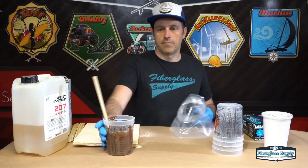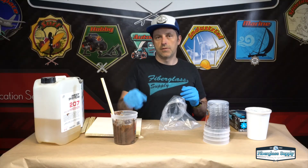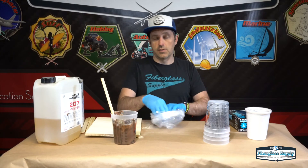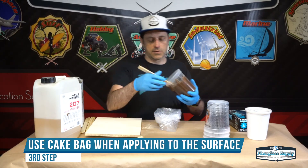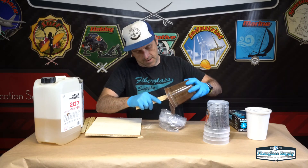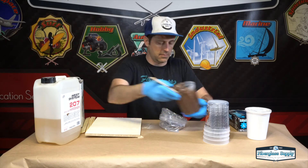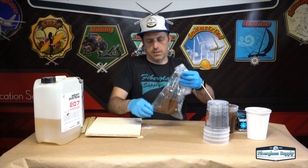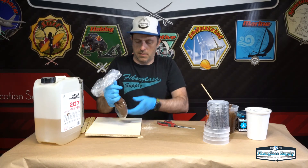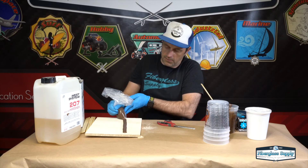Let me grab a bag and I'll show you how that works. We have a whole other video on the gluing process where we show what to do with this putty after you've mixed it, but I just want to touch on this real quick. The easiest way to get it out of the container is to use a cake bag. We're going to simply drop the putty into this bag — really this is just a plain simple plastic bag. Get the putty in there, hold that down, tip off an end of the bag, and now we can just squeeze that out nice and cleanly into our joint or wherever we want to squeeze it in.